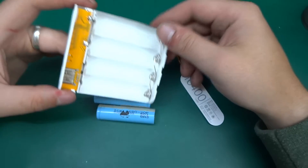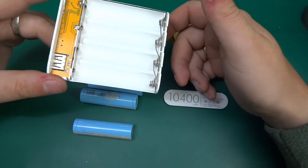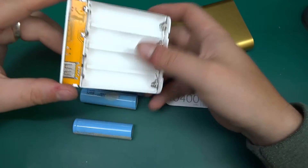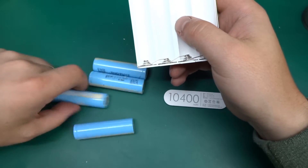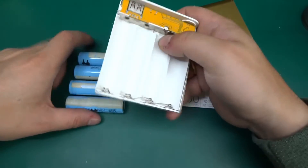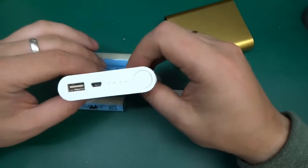When charging, it's important that the batteries are at roughly the same charge level. If you put one fully charged battery and one flat battery in, all sorts of weird stuff will happen — the charged battery will start charging the discharged one and may cause problems. If you put a fully discharged and a fully charged battery together, that might result in flames.